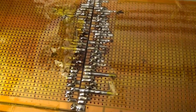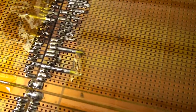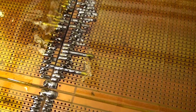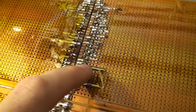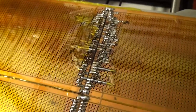If we look at some of these traces, you can see they're not really pretty right now. They've definitely darkened a lot. In some cases, some of these are quite long — those were instances where I had the copper trace tear from being flexed, especially in the hardened areas right next to the soldered staple lead. So I had to drag the solder out and connect it to more of the copper trace surface area. That happened in several places, and became apparent in the testing phase.